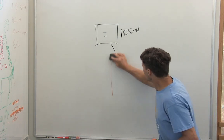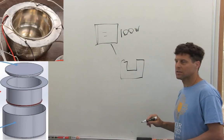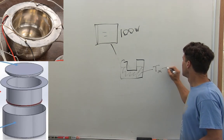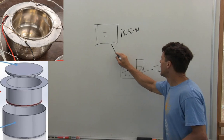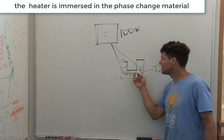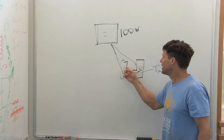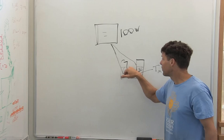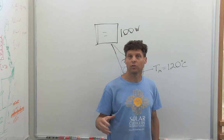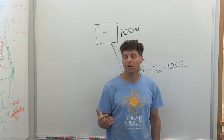So instead, we take this heater and put it in a pot inside of a pot. Here we have a phase change material that melts at about 120 degrees Celsius, and the heater is immersed in that. Over the course of the day, the electrical energy melts this phase change material inside of a well-insulated chamber. You can dump your food in at the end of the day when the sun goes down, and it will very quickly transfer that thermal energy to the food. This phase change thermal storage allows the user to cook after dark and to cook with much greater power than is used to initially melt the phase change material.